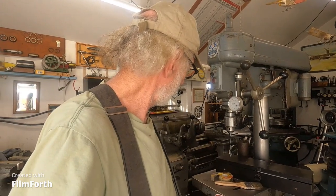I think that's a pretty good game plan - just back off those carriage gibs a little bit and continue to use the machine. It's certainly helping with the spindle bearings, surface finish, and the racket the thing is putting out. I love the video. I've got Chloe's dinner heating now. I'll eat something, take a bit of a nap, wait for it to cool down, get up pretty early in the morning and figure out something cool to do. Okay, bye-bye.